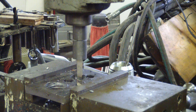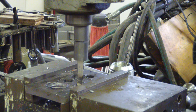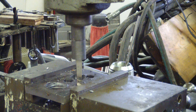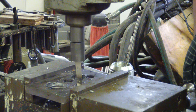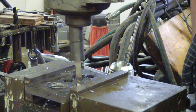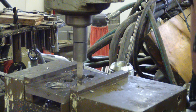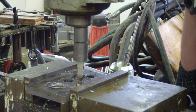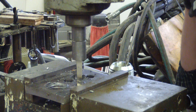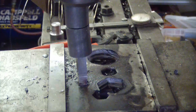What we're doing here is we've got this offset up here driving this tool. The offset is just going to weeble wobble. As it weeble wobbles, it only forces on one corner of this square, or after we grind it, dished tool bit. That's going to broach its way through the hole, taking a little bite each time. We need to make sure that the broach has a little bit of a dish, and that there's a relief angle ground into each of the four sides so that we can clear as we're going through the hole.